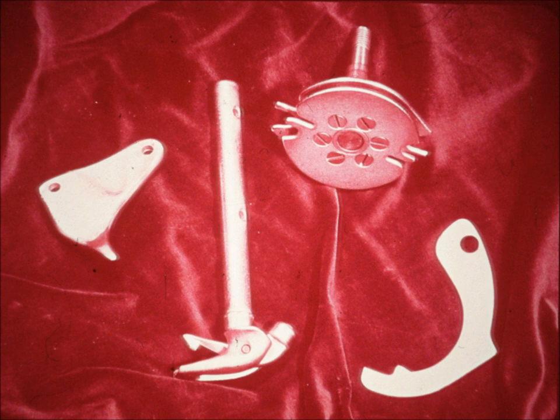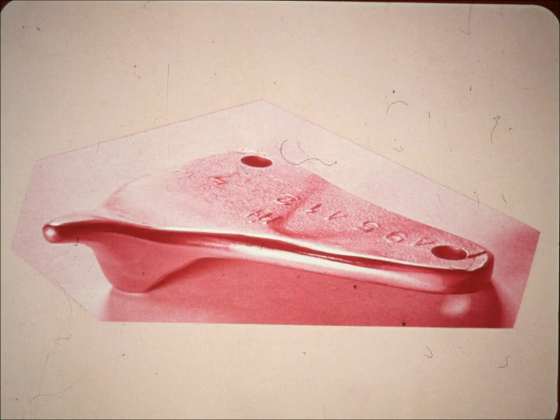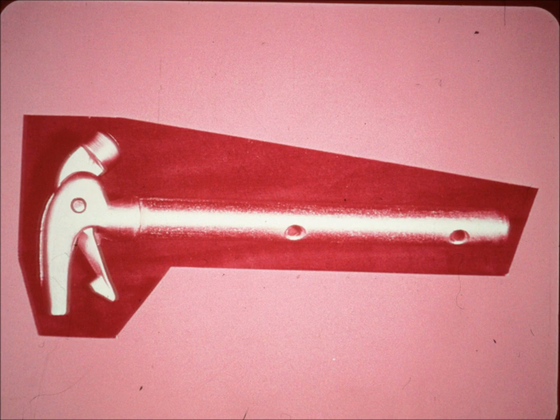On model 37, cadmium plating is used. The chrome plated breastplate finger is thick and rounded to avoid scraping the twine fibers. This reduces twine abrasion, which means fewer broken bales. The bill hook has been enlarged and stretched so that the knot can slip off easily. This construction also reduces twine abrasion by not crimping the twine.